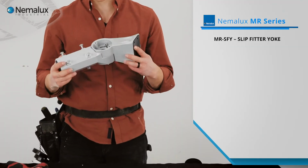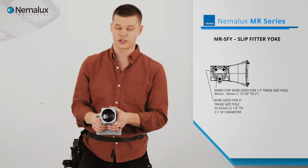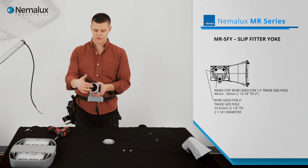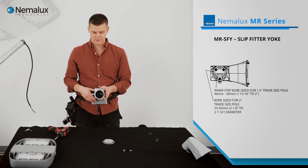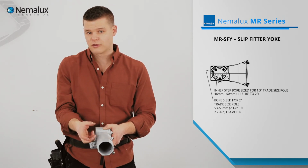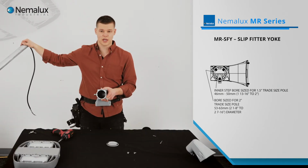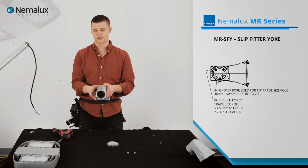It's meant to be corrosion resistant and will work in any type of atmosphere. But a really neat feature with this pole mount is it's designed inside for the largest diameter to be able to fit a 2 3/8 tenon nut. That's a standard pole mount, regardless of height. Then inside there's machine steps that can accommodate all the way down to 1.5 inches. And then because of these set screws, you could even mount it onto a 1 inch or 3/4 inch rigid conduit. Today we've got 1.5 inches. So it'll seat nicely into the step at the bottom and then we'll secure it using these 6 set screws.